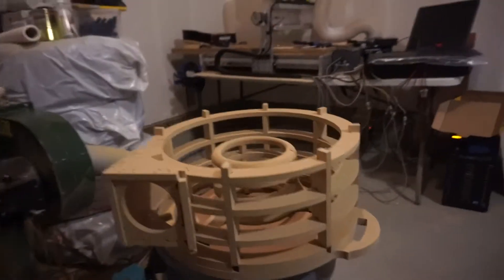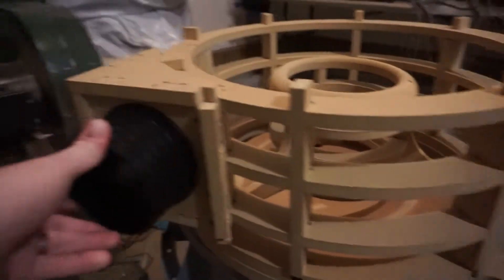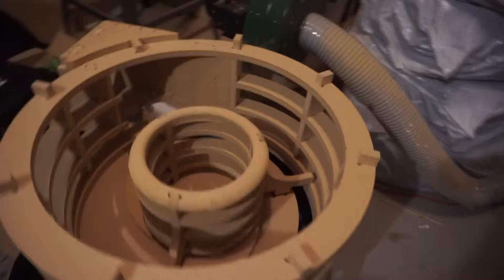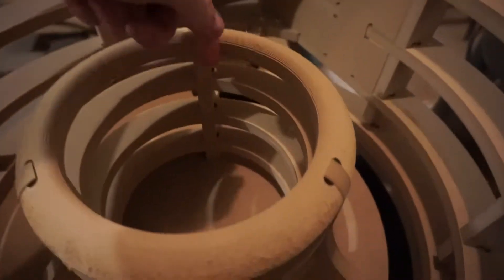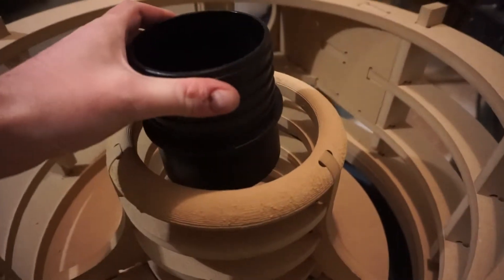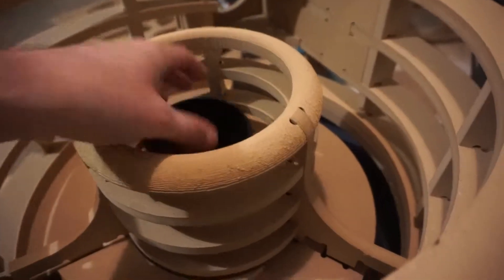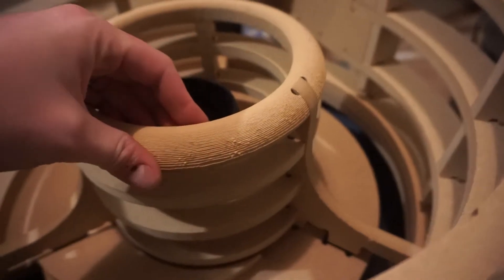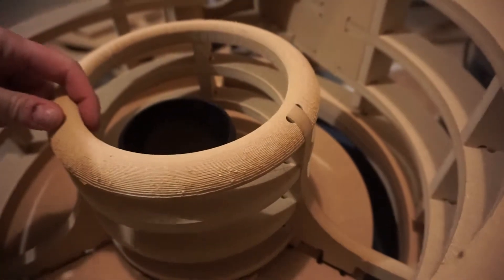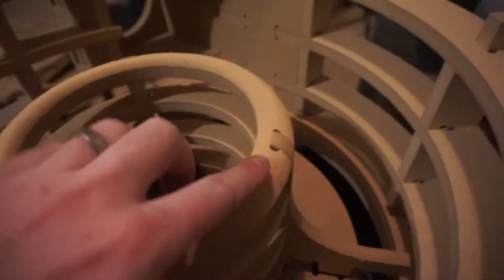This is the dust collector so far. The hose port will go on it over here. I've got an internal circle which will have PET film on the inside, and the top collector sits on the inside of the top plate, sitting just below the surface of the top. This piece I've just cut with a normal end mill - I need to do it with a ball nose, which hasn't arrived yet, so I'll be remaking this later this week. The ball nose end mill should give me a pretty much sanded finish to smooth the airflow so it doesn't trip on the hard edges.